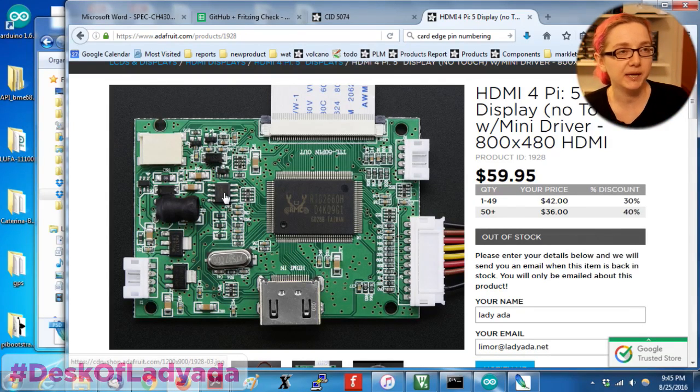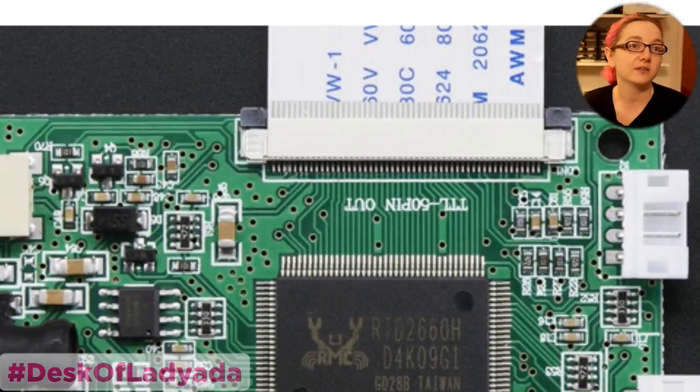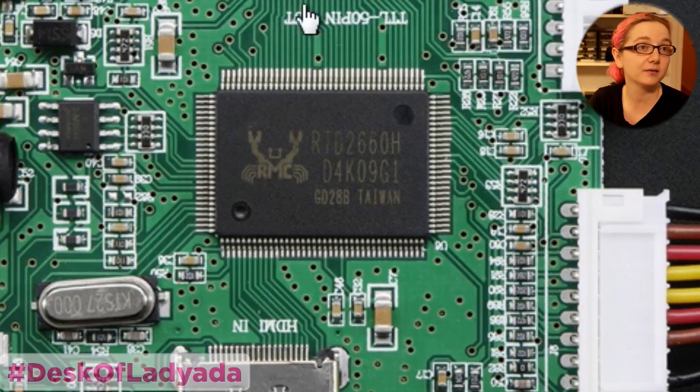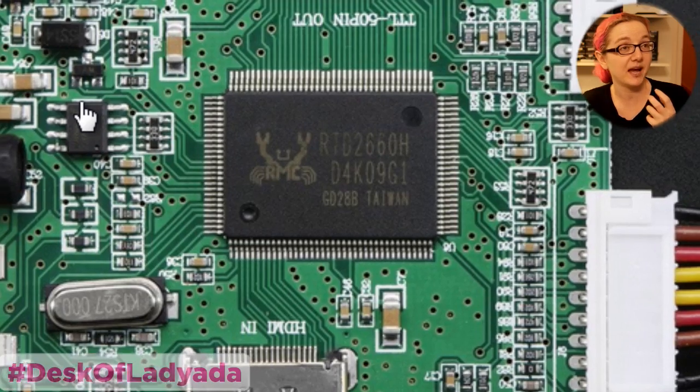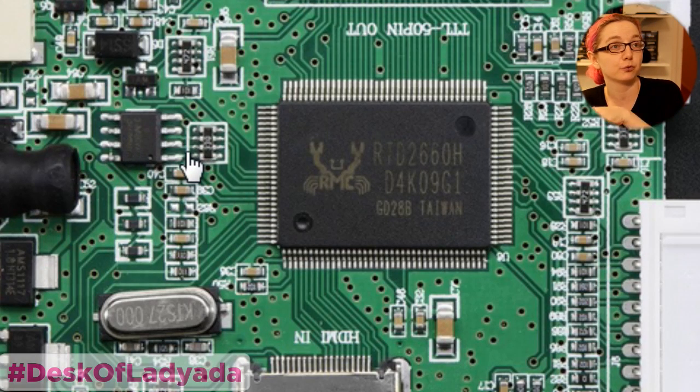It's a 1 megabit SPI flash, and that's actually really good news. Even if you don't know the programming interface for this, later on we did find some people had reverse engineered it already, so that's all lovely. But at worst, if you need to reverse engineer this and you want to program your board, you can always get one of those SOIC clip-ons and just read this. It's SPI flash, so just read the SPI flash off. Very simple, well documented, and then for the board that you're manufacturing, you SPI flash the other way. So it's very simple.